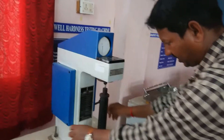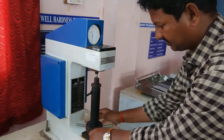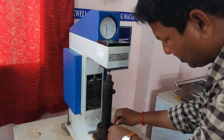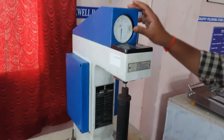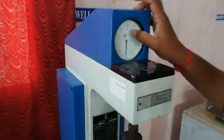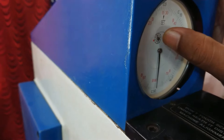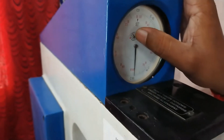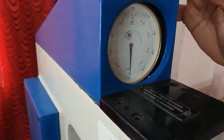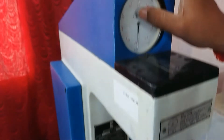Initially you have to apply the preload to the workpiece — just to touch. Now see the dial. On the small dial, you have to apply force up to the number 3, which is the maximum. You cannot go beyond the red mark; that is the maximum limit. The dial indicator may get damaged if the small pointer goes beyond the red mark. That is a very important point.